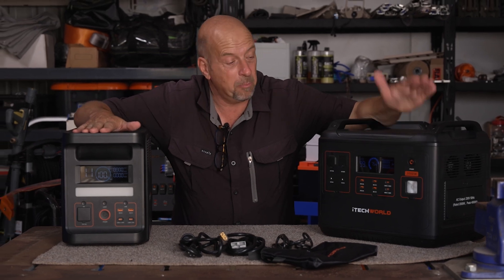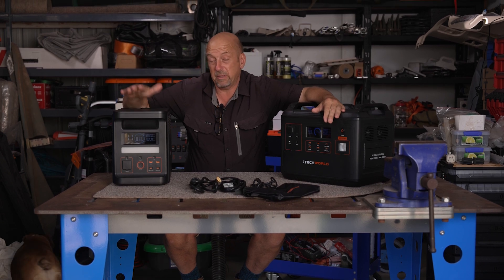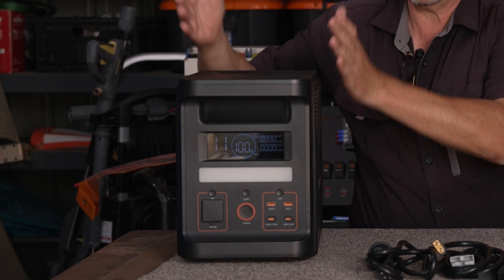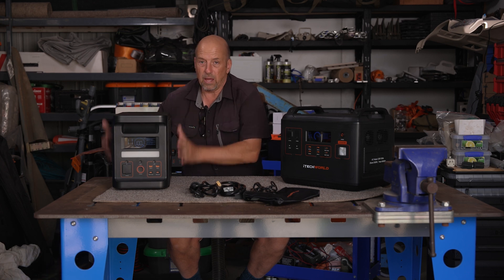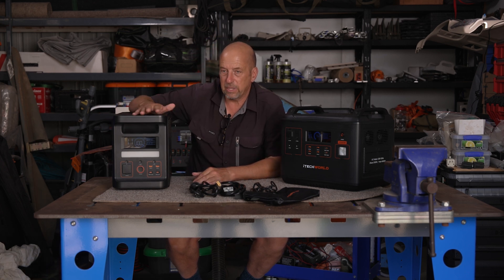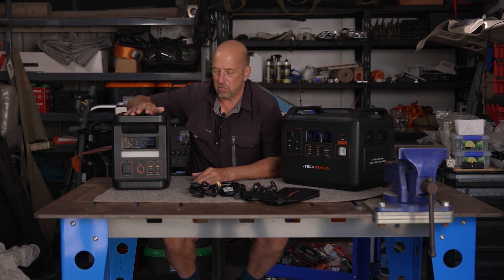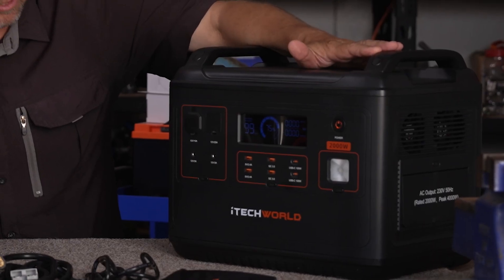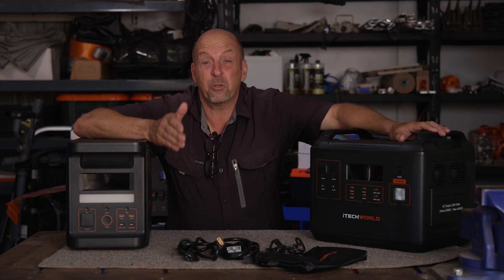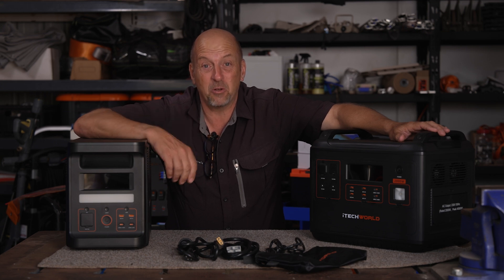So there you have it — the 1800W Pro and the PS2000. My preferred choice would be the 1800W Pro: the smaller form factor and the ability to increase capacity with the add-on extension battery makes it a real winner. It can tuck down the side of a four-wheel drive wheel arch nicely. Bear in mind neither unit is IP67 rated, so keep them in an internal environment. The PS2000 is heavier at 22 kilos, so do your homework and make an informed choice. Comment below with any technical questions, and we'll see you on the next episode of What the Tech.